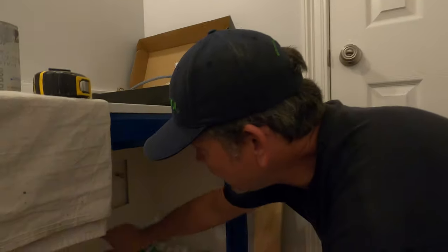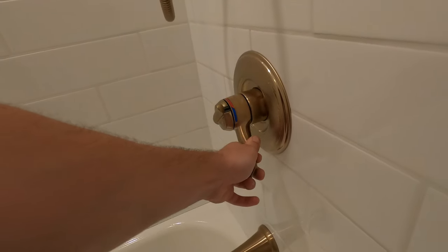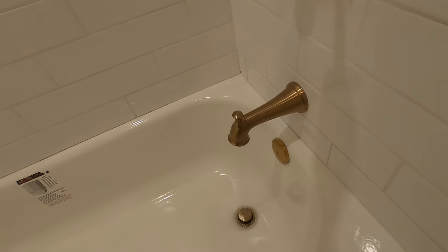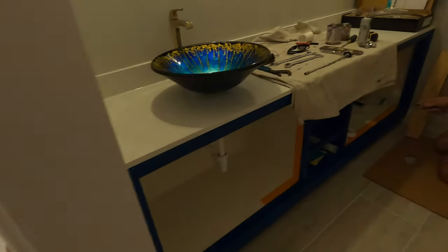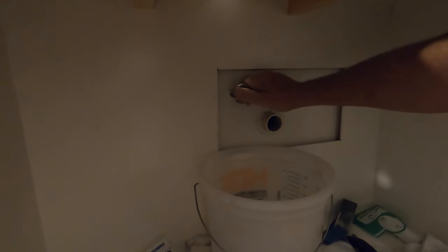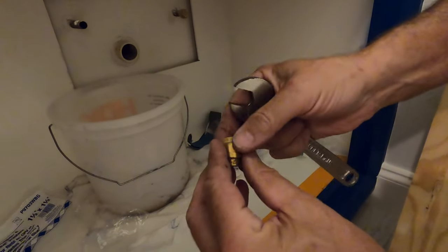Let's put these on. I'm going to go outside and turn the water off, and we're going to remove the SharkBite caps. The water is off. Jordan, why don't you go ahead and turn the tub on and take the pressure off the system. On these SharkBite caps, I just take them off with a crescent wrench — they make a special tool, a little horseshoe-shaped piece of plastic, but this works just fine. All the jaws of the wrench are doing is pushing on this collar that releases the teeth.